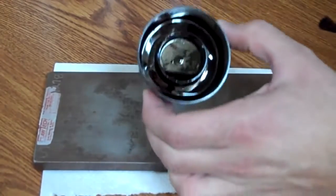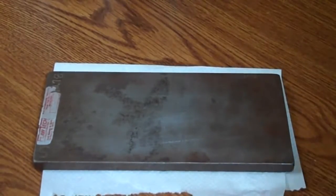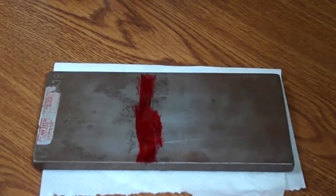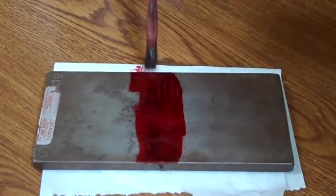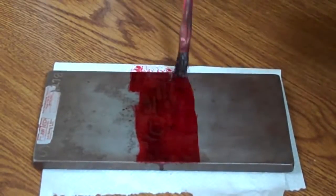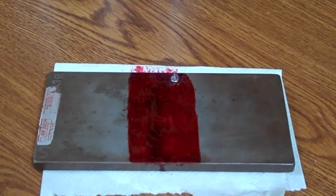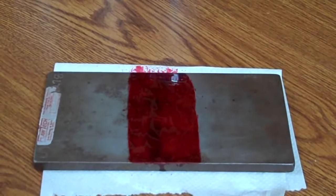I just took a little bit of that visible dye penetrant and sprayed it in the top of this cap to try and keep down on the mess. I'm going to use the brush method. I'm pretending I've already pre-cleaned with this, which I actually have — I sprayed it down with that solvent prior and let it flash off. I'm just brushing my penetrant on there. I'm doing my visible dye — basic method overview. Really nothing too terribly difficult about it. Let my penetrant dwell there for a second.